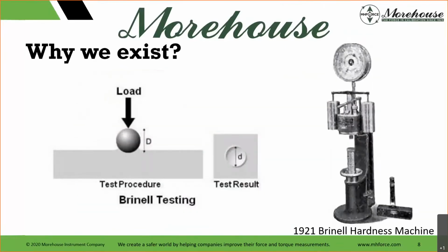So we're talking about hardness testers. Here's a picture to the right of a 1921 Brinell hardness machine. What was basically happening here is the pneumatics in this device were inaccurate at best. You get kind of a reading, but the material lots were varying all over the place. And why this is important is because it's the hardness of the material that drives everything that is built. In order to determine the strength of the material, they needed to develop a test protocol to prove the material was strong enough to withstand the forces exerted upon it.